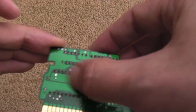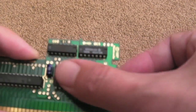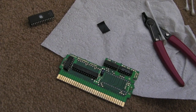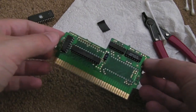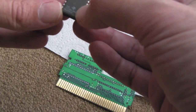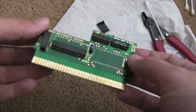Again, that was incredibly easy - it really was. You can see it's looking quite good, nice and tidy. I've covered the window. I'll give this a try and see what happens. Well, I've had a bit of a moment of being a bull in a china shop. In summary - I've removed it again, and the reason it doesn't work is blatantly obvious when I think about it. This is a 27C256, which is 32K. When I look at the original binary, the size is 128K.